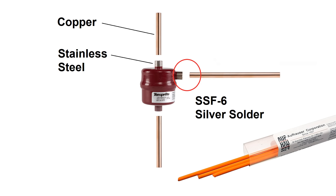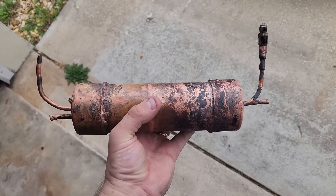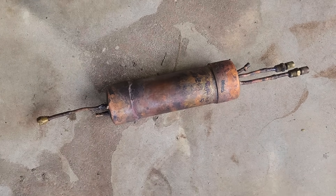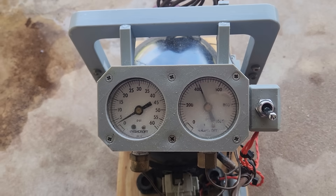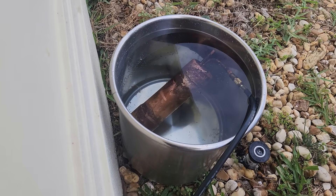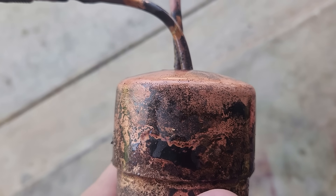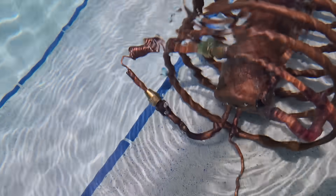Picking up where I left off in my last video, I had a pretty scary explosion when the liquid methane holding tank blew up — well, technically it ruptured, because it didn't fragment and throw shrapnel everywhere, but it did tear open at the brazed joint. So I rebuilt the tank using proper end caps this time. It's a two-and-a-half inch copper pipe with a coil of quarter-inch tubing going through it. I hydro-tested the tank before installing it, and fortunately it didn't blow up, although the previously flat end caps were bowed a little bit after being under 400 psi.